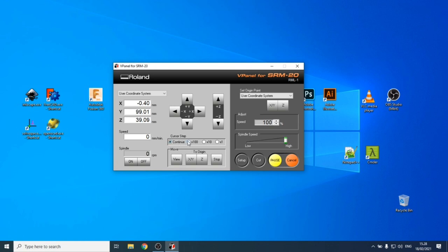Whenever you're getting close to limits where you might break the tool, change the cursor step settings. The x100 setting means it moves one millimeter at a time — one step equals one hundredth of a millimeter. You can go as low as one hundredth of a millimeter. When you change to x10, the value changes in tenths of a millimeter; at x100 it changes by one millimeter.